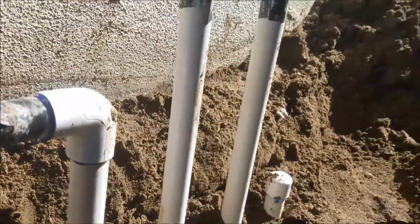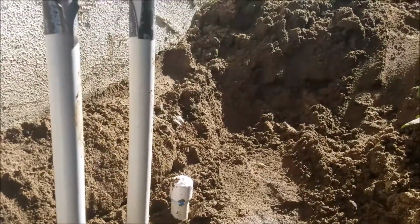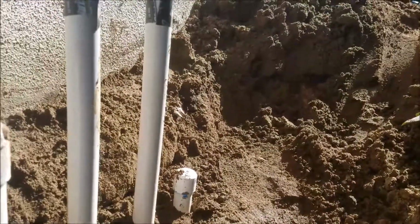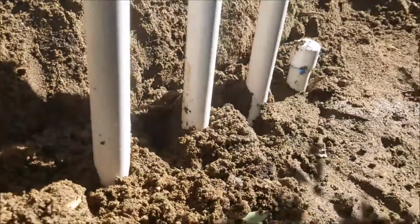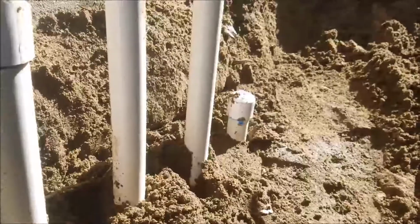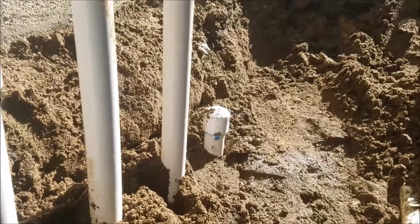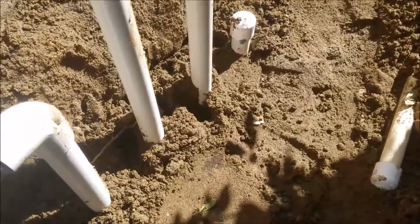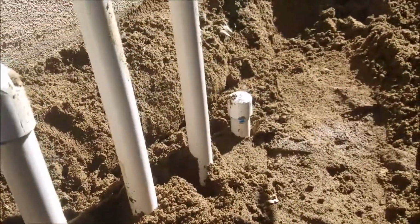It's in here, okay? When it gets done, what I like to do, and this is just me, I go ahead and I fill it up. I take the end of a shovel and I compact around any penetrations of pipe through the ground. That's the way it's supposed to get done. Additionally, if you could get your foot in there, what I like to do is go ahead and tamp down, get it compacted. But just keep in mind you don't want to move these around too much.